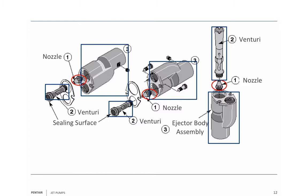Our AL and BBL series pumps had the drive hole on top. When we switched from AL to SL and BBL to HL, we changed those two holes around to what is called industry standard. We did it for one very simple reason: people were tired of having to buy a reversing adapter to get the pump hooked up properly. When changing the pump out, it was hard to put our pump in when somebody else's jet was already there, because of differently set pipes.